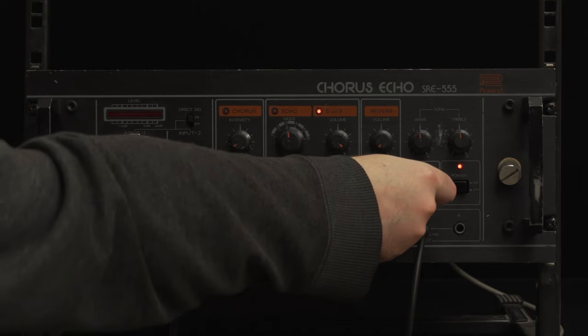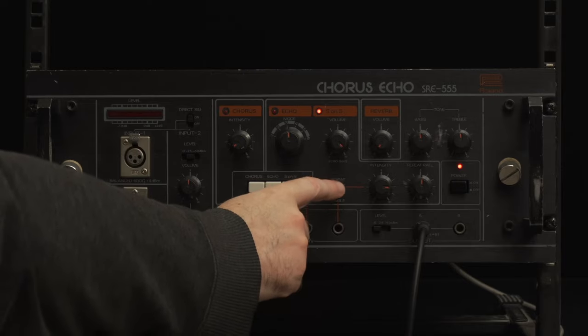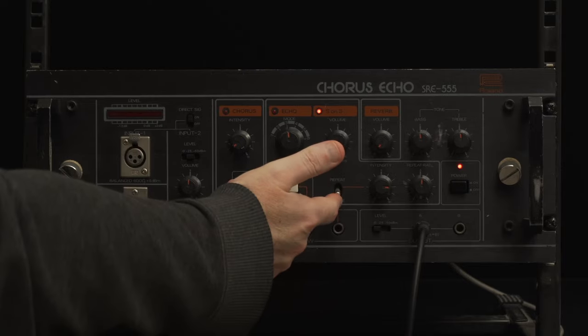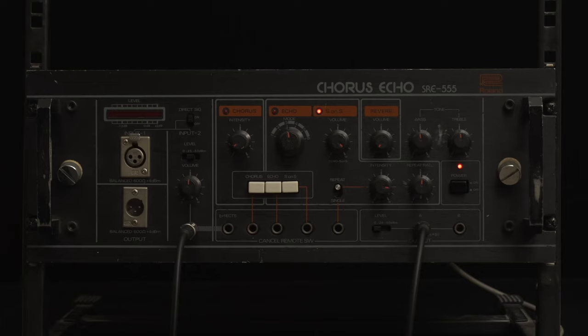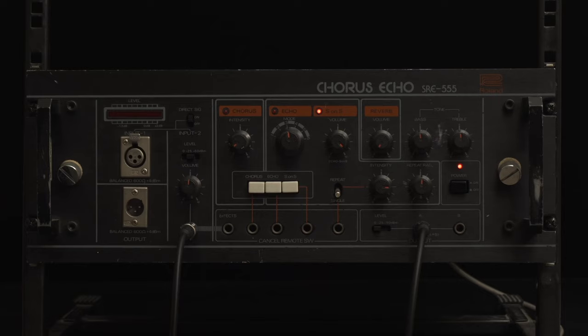And the thing to note is, you'd only really make use of the sound on sound, or S on S, in conjunction with the repeat switch set upward, which produces continuous repetitions of whatever particular audio signal you put in. Alternatively, set your repeat switch to single for a single repetition, or what I call budgie mode. A sound-on-sound looper can generate some cool industrial effects and can be useful in sound design or anything where syncing to a time or beat isn't really necessary.